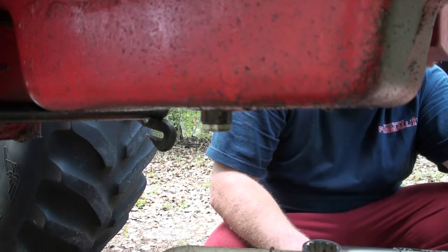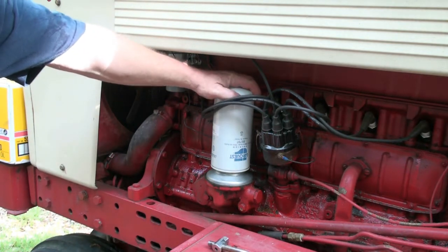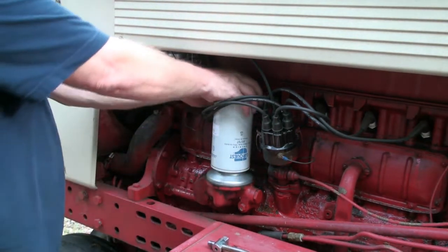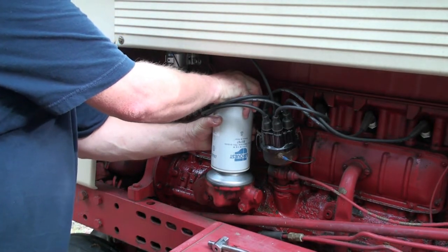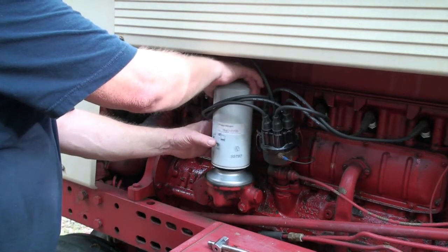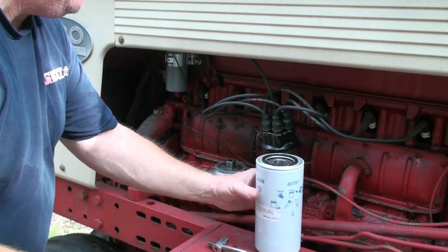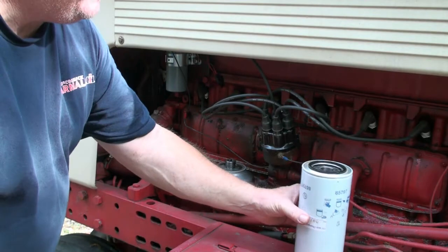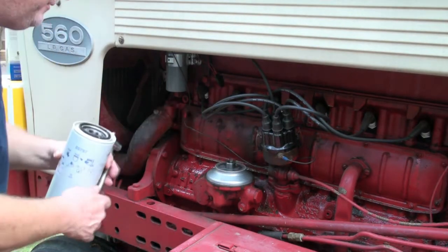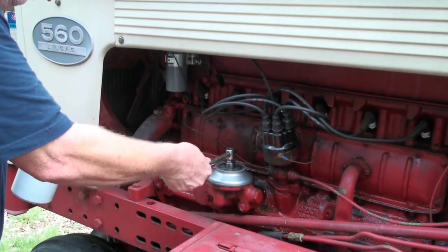If you don't have the right wrench for your nut, don't touch your nut. As most of y'all know if you've been watching my stuff, I've got spin-on filters on all of my tractors — they've been converted. I don't like to use a wrench putting them on or taking them off. As often as I change my oil, y'all would probably suspect a wrench isn't needed. When I take these filters off, I go ahead and check my nut here — see how it's loose because I just unscrewed the filter — so I just put this in here and snug it back up.